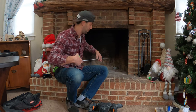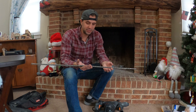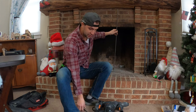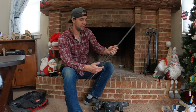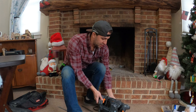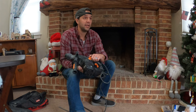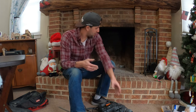Now we're going to get to the point where we actually start drilling a hole. To drill the hole you're going to need these SDS bits — these are made by Bosch, I got them on Amazon, I'll put a link in the description. I chose half inch and I bought two sizes because the longer one is great but look how long it is — I've got to get a drill in there. So what I'm going to do is drill a little bit with the short one and then follow up with the long one. You're also going to need one of these big hammer drills — these are awesome. You can rent these from Home Depot, but I just bought one from Amazon. I'll put a link to that down below as well. When I put my pool fence in I used one of these and it worked great.